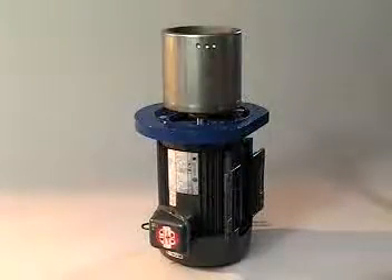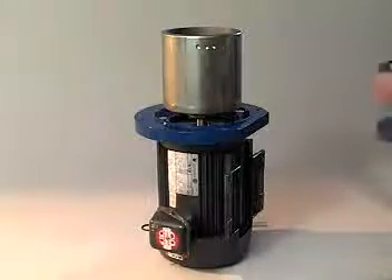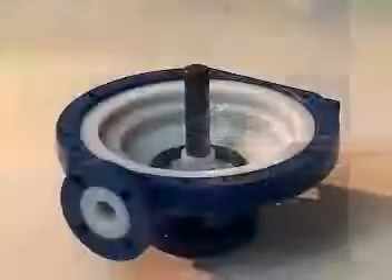When you are ready to reassemble the MTA pump, begin with the motor and outer magnet combination sitting on the motor fan cover with the outer magnet at the top. Attach the frame adapter to the motor adapter with four bolts and an end wrench.